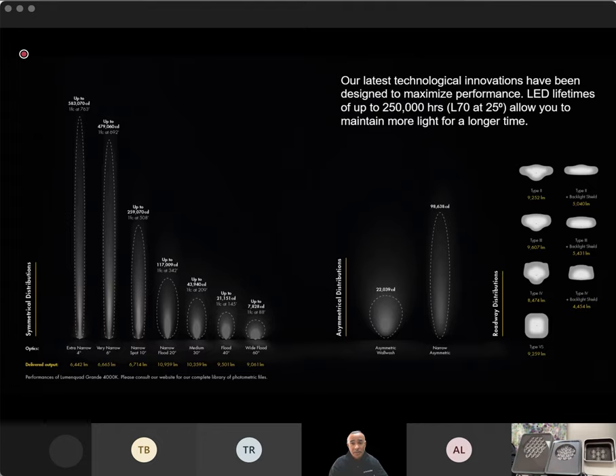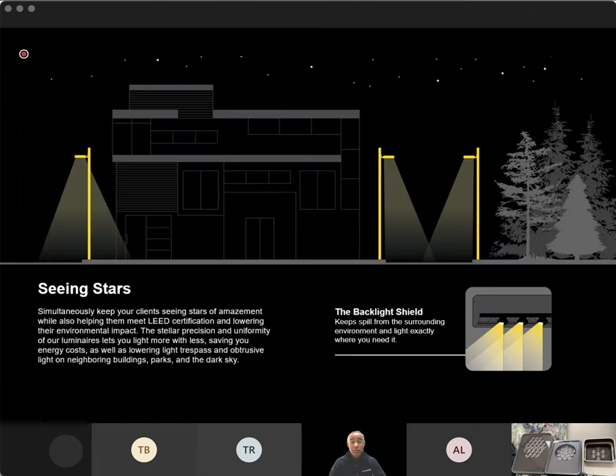With this fixture looking great on poles, we wanted to make sure to add roadway optics. Type 2, 3, 4, and 5 square optics are going to be standard with the quad family. With those roadway optics we wanted clean cutoffs — we can run EPA and BUG ratings for these fixtures. For the clean cutoff, we offer a silicone cap that sits on top of the diodes, especially for our type 3 distribution, where you can get a really nice clean cutoff as shown on the right-hand side of the screen.